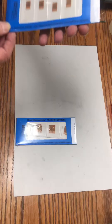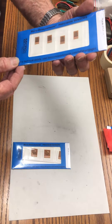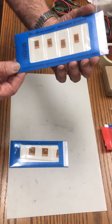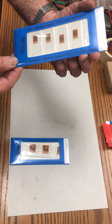This particular gauge is a CEA06187UV-350 ohm strain gauge. It's a half bridge, and one can put two of these gauges diametrically opposite on the shaft, wire them up as a full bridge, and get a measurement.